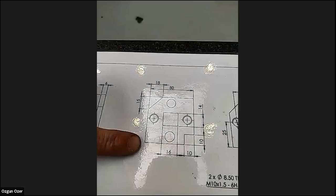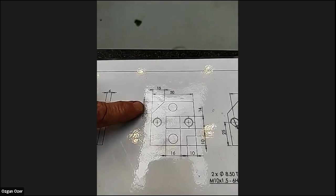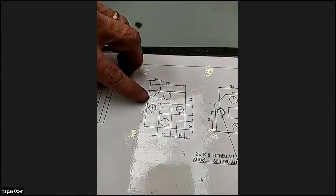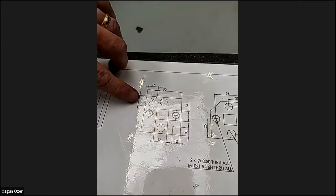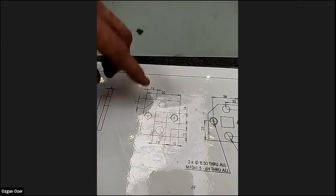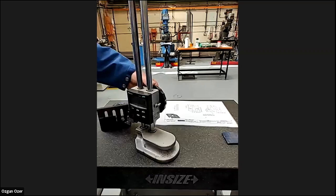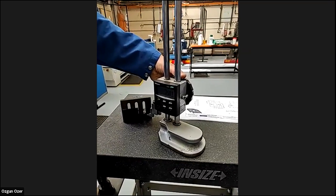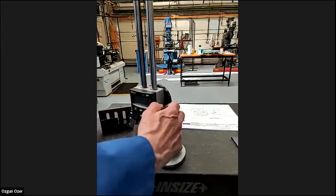So we're going to mark from the bottom, we're going to mark up. But rather than turn the job round, because if that isn't exactly right we're going to make a mistake on this corner, we always need to measure from this point. So we're deducting 15 from 50. Okay, so 35. Yeah, 35, exactly. Thank you.